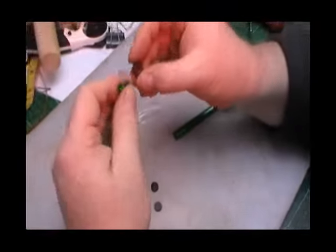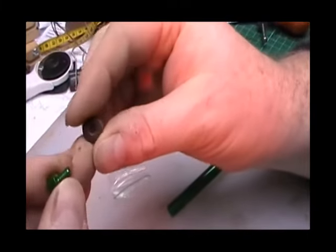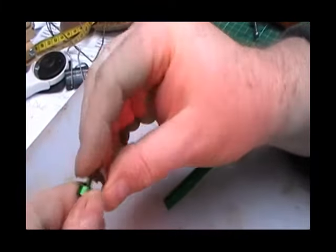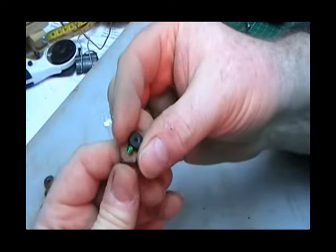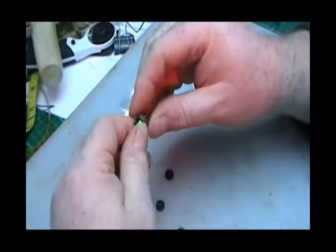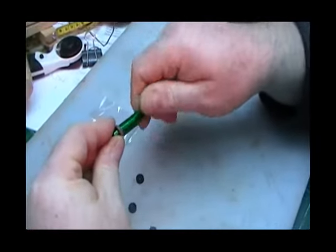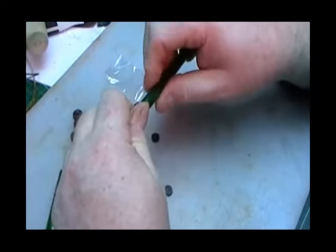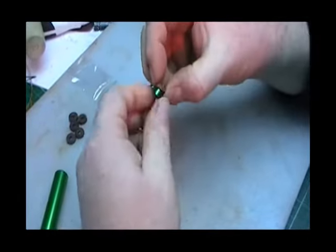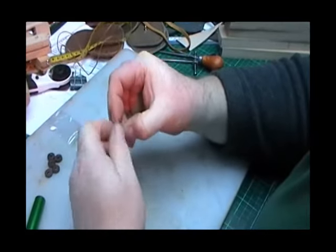As you can see, the leather grommet is a little bit bigger than the rubber grommet so we have to make it fit, because obviously when it's screwed on like that it won't fit in the barrel. So what we need to do is take the grommet and wet it.